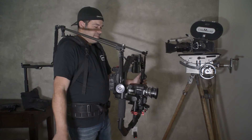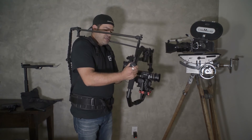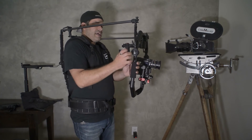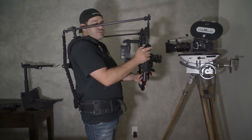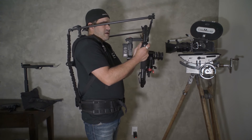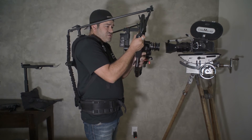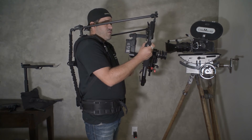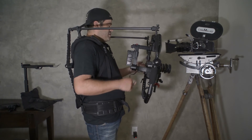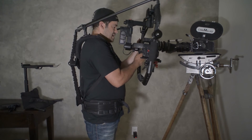I'm going to slowly take some weight off and look at what number is on the tube. I want to drop it by about an inch. I loosen the spindle mount and slide it down to where it says two inches on the tube. I'm using these markings because I had the tube adjusted so it's facing me and I can see what I'm doing. Now I tighten that. Of course now they're in different places, so I want to do the same thing to the other side — loosen it and slide it down to the number two marking.